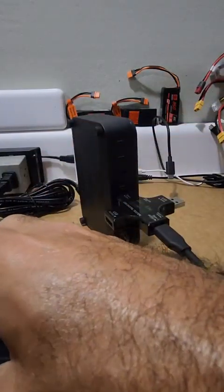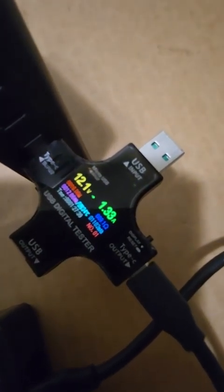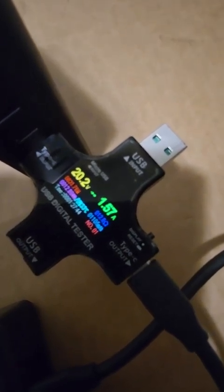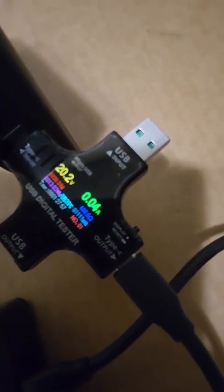As soon as I do that, I'll shift up to this so you can see some amps roll. All right, that little beep was that it is in charge mode. Jumping up, look at that. And that's at a 3 amp setting, so I'm gonna stop it. It's getting at 1.89. Looks like it's 1.9. All right, going back to 1.89, so I'm gonna stop that charge, let it zero out, change the charge rates to 6 amp. Boom. Should get a little bit more than we did before.